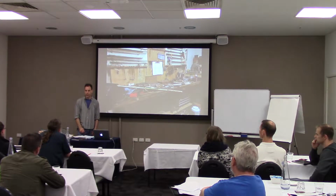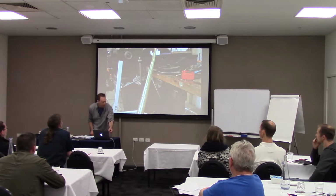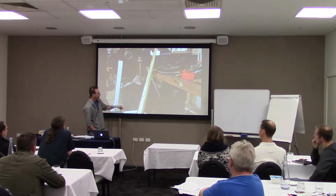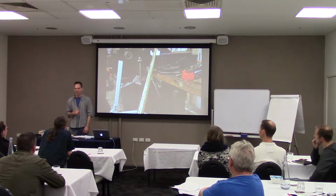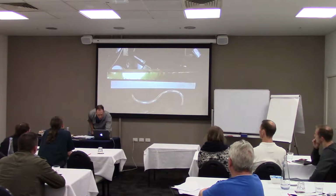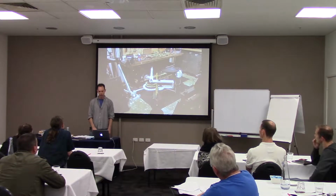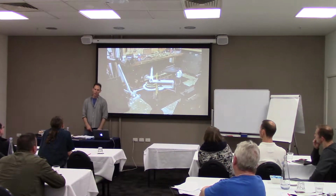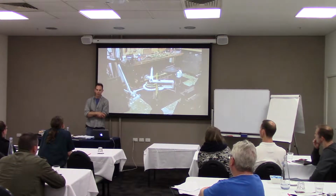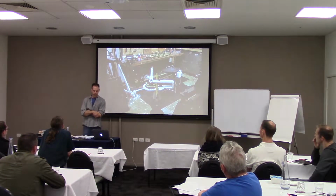I do try to make them as clean as possible. You can kind of see it down in the corner here. I've got a chop shear, and I usually do those, and that keeps it nice and clean. That's a horrible picture. Let me see if I have a better one. It's kind of down on the floor. It's fairly deep throat, but it'll cut a nice straight line. But I usually use my metal shears, you can see them up in the top there, just by hand. And that gives me a straight edge.